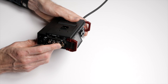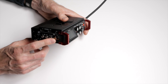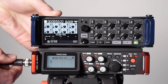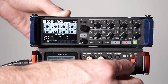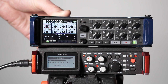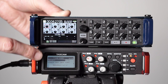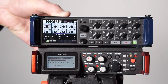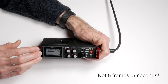The HDMI output also lets you send the video stream to a monitor, so since most consumer cameras only have one HDMI output, you can still monitor video while recording to the audio recorder. The unit also has a BNC input for timecode — many professional devices use timecode over BNC. This is not a timecode generator but has a timecode clock. I used my Zoom F8 as the master clock, jam-synced the TASCAM, disconnected the cable, and let both run for an hour. I found the TASCAM was already five seconds ahead of the Zoom after one hour.